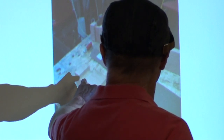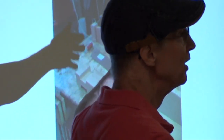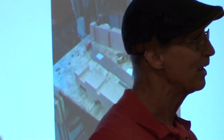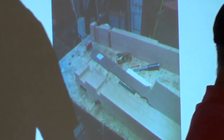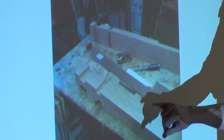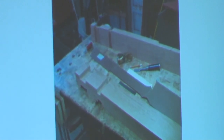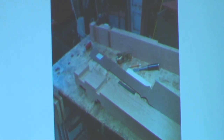For instance, using simple math: if I'm taking a half inch off here and a half inch off here, I've got an inch off. If I want to end up with an inch and a quarter, I obviously need to mill this thing exactly two and a quarter. But if this piece isn't milled exactly like that piece and I'm cutting the same amount out, I'm not coming up with the same dimension. The better your joiner and planer work, keeping chalk marks — the better you can mill your stuff, your craftsmanship goes up.